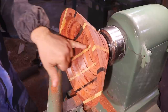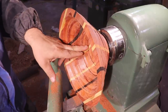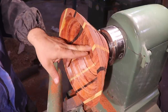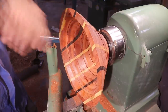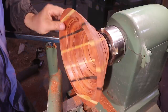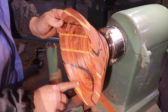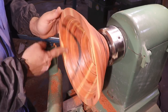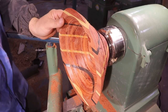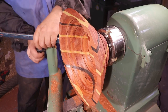That's just a straight in cut. I've got 5/8 of an inch left in the bottom of this thing pretty well, so I can make this transition cut decently. It's going to be a steeper angle on the bottom though, where normally I would turn it, but that's just this design of bowl. And it looks like I'm a little bit void of glue right here, but I'm hopeful that it's just squeezed out on both sides. So I'm hoping that there's lots in there. Anyhow, if there's not, I will put some thick CA in to compensate for that.